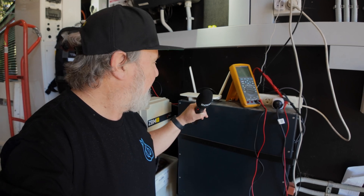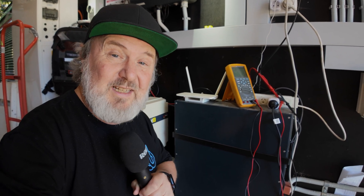The comms is really good, so let's check out the DTU. This little white box behind me is the data transport unit. What I'm really impressed with from Hoymiles is their communication system. This little unit connects to the cloud, so we've got cloud monitoring. But how does it connect to the microinverters? Through an industrial strength Wi-Fi signal.